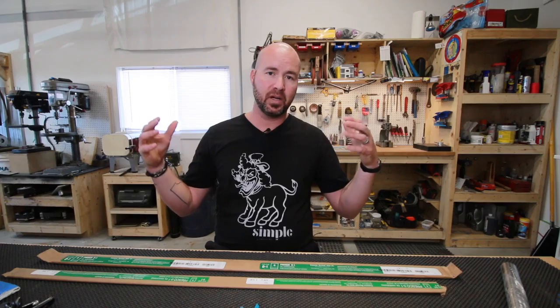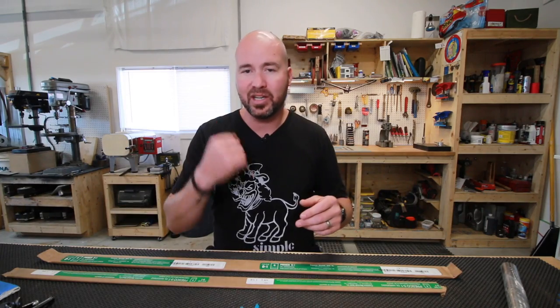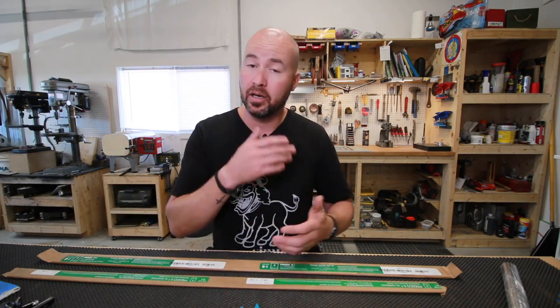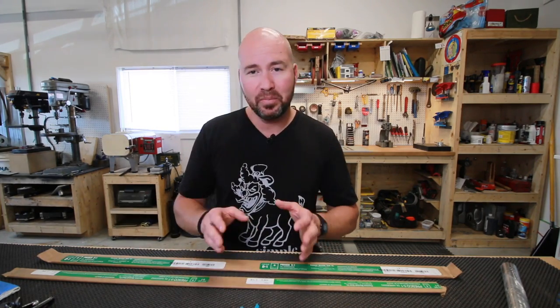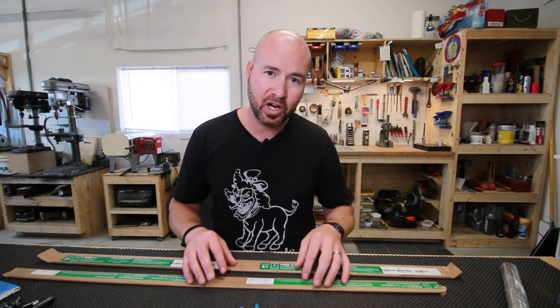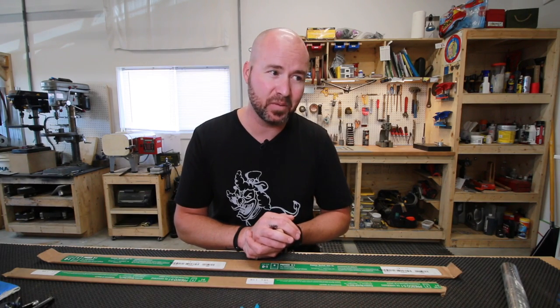When you're talking about commercial heat treat setups, some of the bigger companies actually have furnaces they can control. They'll run a shielding gas in them so they can create an inert environment that way. But it is something that happens. It is something you need to consider and know about. Ultimately, if you want the best performance from a stainless steel, you need to control the environment that it is austenitizing in. And I think that's about that.